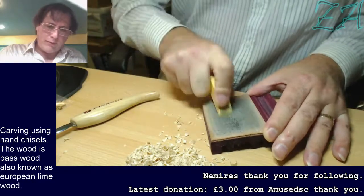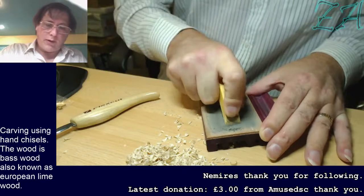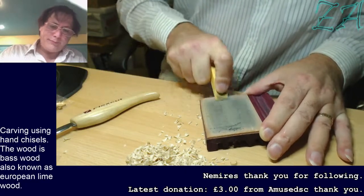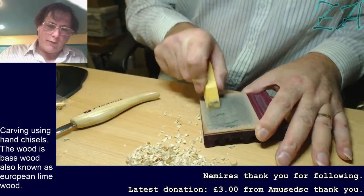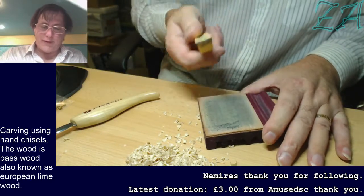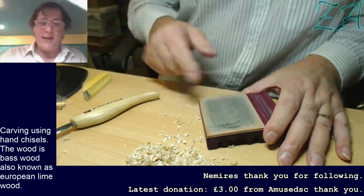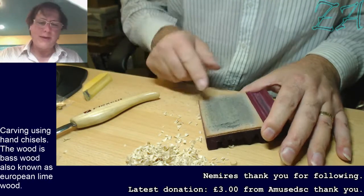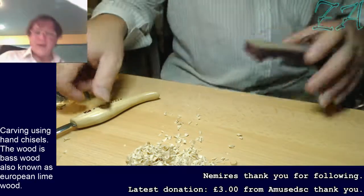This is all I'm doing here, is putting some polishing compound onto this piece of leather, which is glued to a block of wood. It does two things actually doing that. It takes off the black that you can see there. It's both mixed polish, but is also metal. Any sort of polishing removes metal from what it is that you're polishing, and it goes onto the strop. I just knock that off.